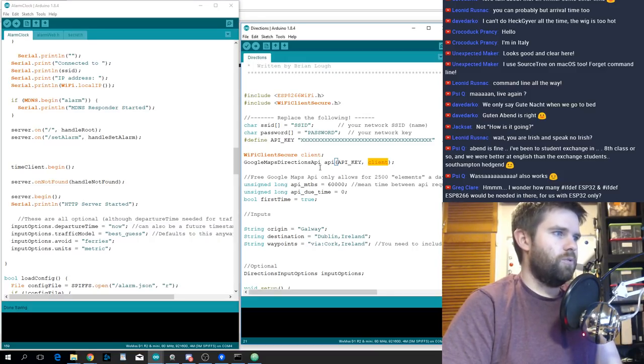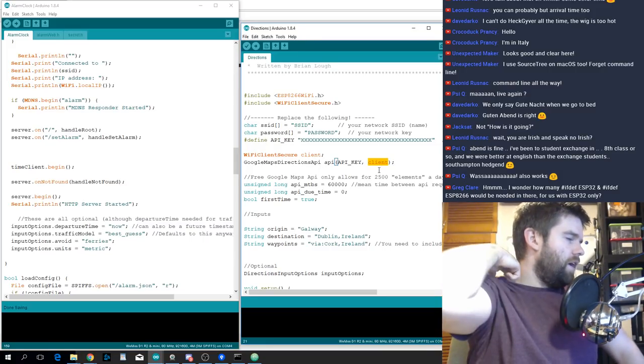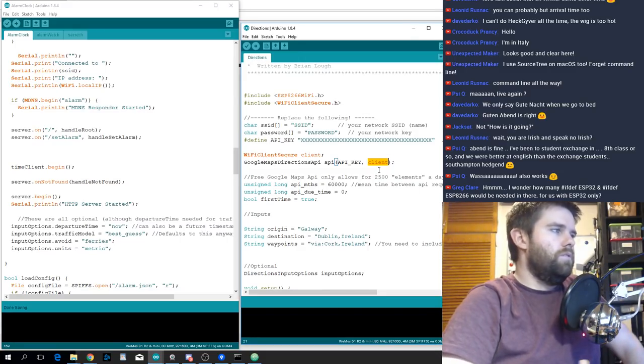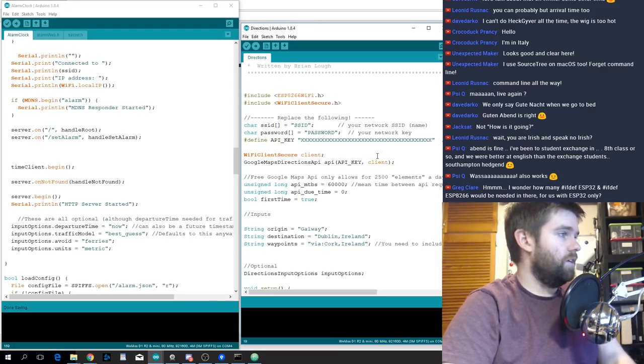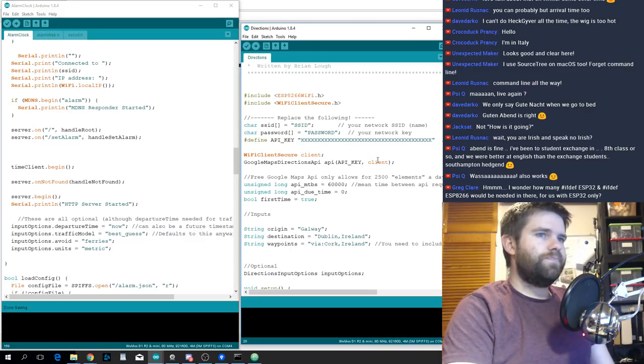It means that you don't have code like, if I'm an ESP32, initialize this, and if I'm a whatever, initialize that. It's happened before with the Telegram library that someone wanted to try it with a SIM800 module, and I came across a TinyGSM library that wraps that SIM800 module into a client interface. I had never tested it, but the guy passed it in like this, and it worked. So that's why I pass in the client from here.